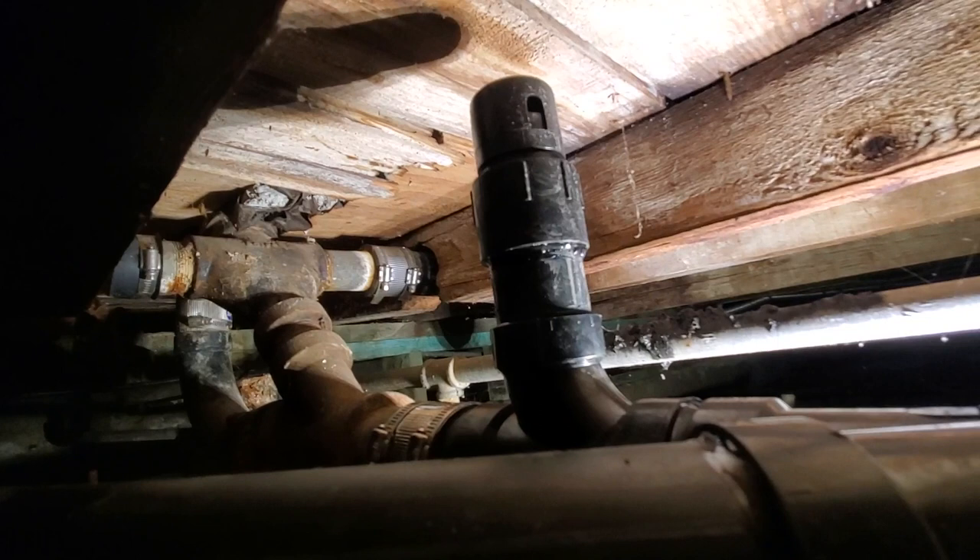That double fixture fitting is so corroded — when I cut it, there was so much crap in there — so since this isn't going to be inspected, I decided to wet vent this shower just to make sure the unit next door has enough air. On top of that, if you go downstream of the Y I just tied in, you have a vanity drain which is vented, and then the stack is right there, which is obviously vented. So this shower drain is getting plenty of air — it's just being wet vented. Quite frankly, I probably didn't even need that AAV and everything would have drained fine.